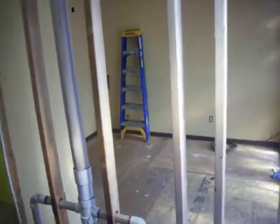Just an update on the work on the house. We're getting ready for the framing inspection, and as you can see, I've cleaned out most of the tools and organized everything, so when the inspector shows up early next week, they can step in, take a look at everything that they need to see, and give me the okay to put the OSB sheeting on the outside and hopefully get this project, as far as the building permit is concerned, put to bed. Once the OSB is outside, they need to inspect it one more time, and then we'll be done.